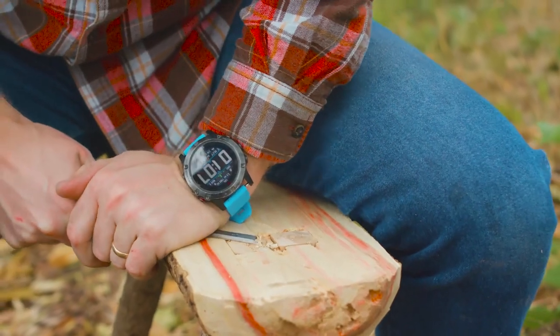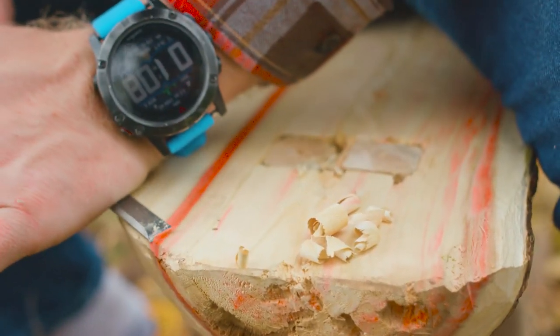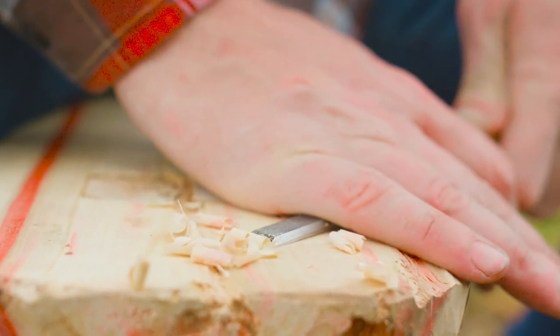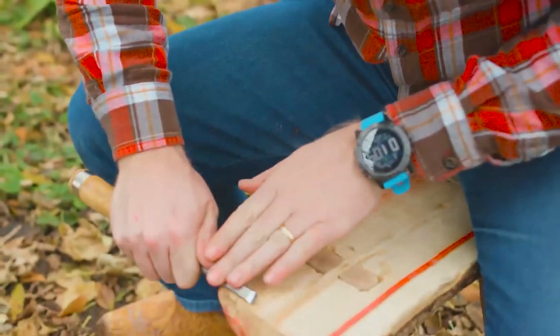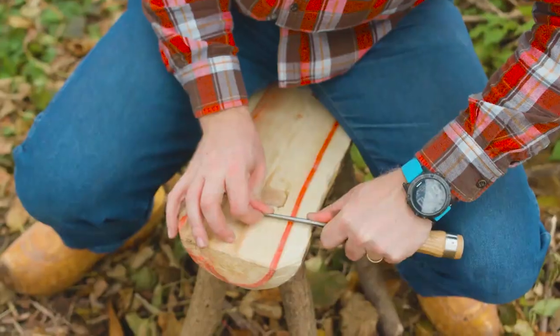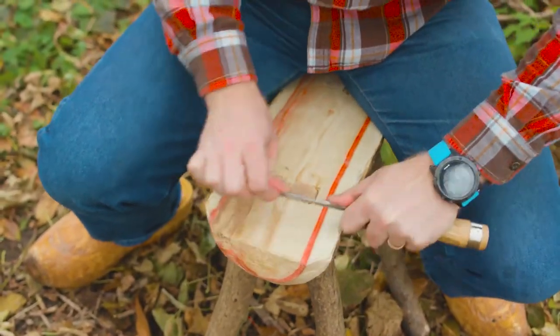And the nice thing is you can get them nice and flat and smooth with the rest of everything else on the bench top. And then we can do our final detail and smoothing using the chisel as a plane and then the side of it as a card scraper. And ooh, we're starting to get good. It's just the last little details on this and make it happy. I'm not going to add any finish to this because I made it in the wood. I guess I could rub some walnuts on it, but I just like leaving it the way it is.